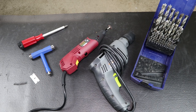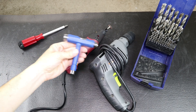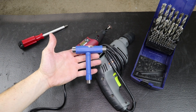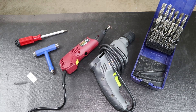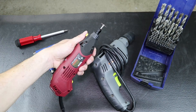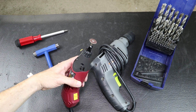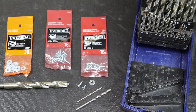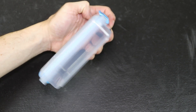Now let's see how it's all put together. I'll start by showing all the tools I used to build this board. You'll need basic skateboard stuff like a skate tool, socket set, or pliers, a screwdriver, and a razor blade for the grip tape. For the electric skateboard specific parts, I used a drill, some drill bits, and a rotary tool — I got this one for about $25 at Harbor Freight. The only attachment I needed for the rotary tool is the cutting wheel. For the drill bits, I used a half-inch bit, a 5/32-inch bit, and a 3/32-inch bit.